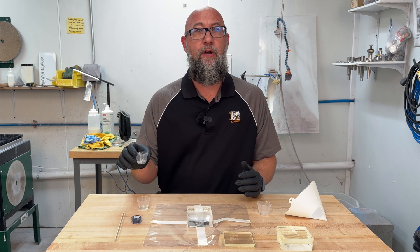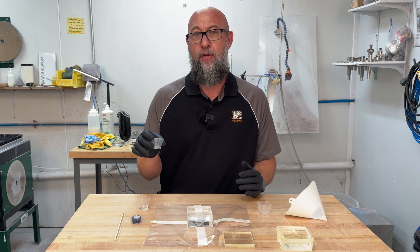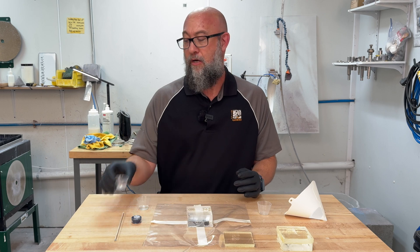If you do use your Part A, I tend to recommend warming it up either in a hot box at about 100 degrees or in a microwave for a few seconds to thin down the viscosity of the Part A. Part A is not terribly problematic with heat. Part B is — you really don't want to heat up Part B too much or it will cause it to yellow slightly, which will change the color of your eventual joint.